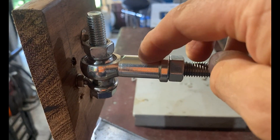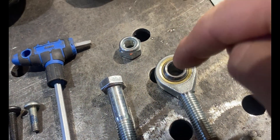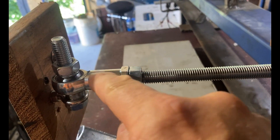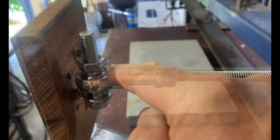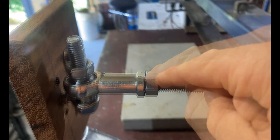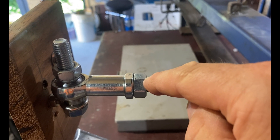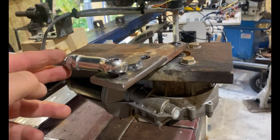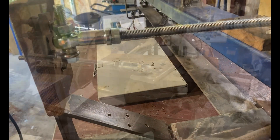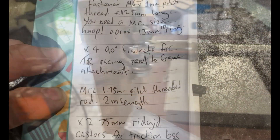You are going to need M12 with a 1.75 pitch thread female thread - you want an M12 ball with an M12 1.75 pitch female thread tie rod end. You will also need six regular M12 1.75 millimeter pitch nuts because they will be at every fastening point from your tie rods to lock your tie rod in place.